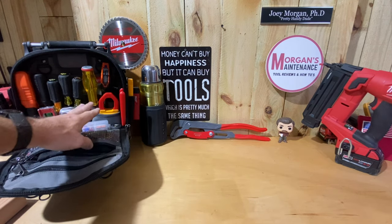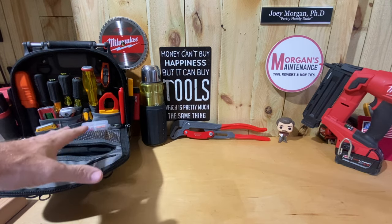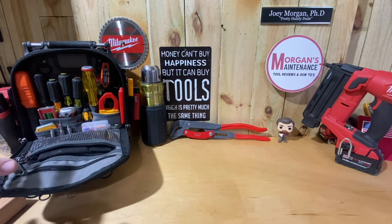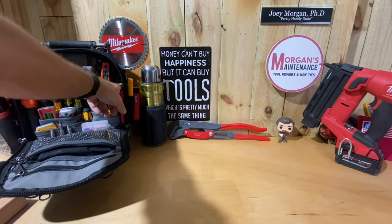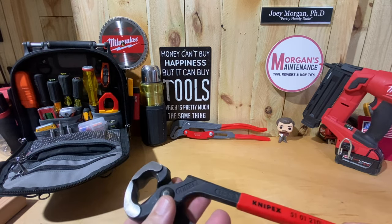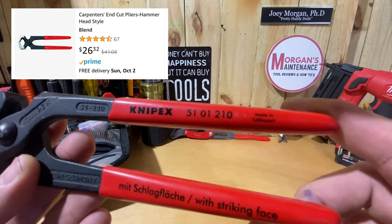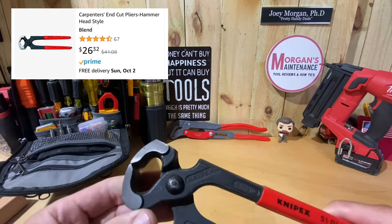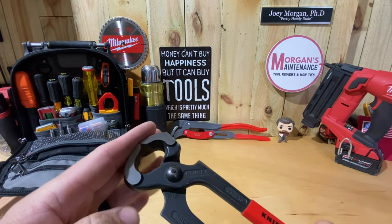You can see how well it fits in my bag, and I want to point it out before I pull it out because that's the whole reason why I bought this tool. There's one specific function on it and it was going to fit in my bag well. This is the Knipex hammerhead style carpenter end cut pliers. The part number on that is 5101210. I bought it for this smooth end — that's that hammerhead style — because they've got many versions of these end cutters.